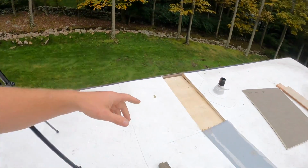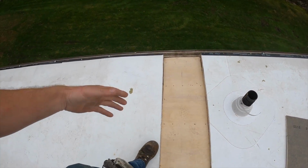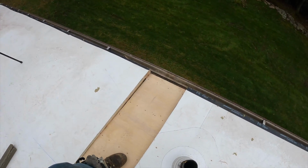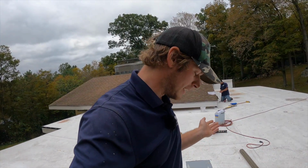Now that we're fully insulated underneath the plywood, we fully insulated with rock wool because the insulation there was kind of nasty. Then we put 2 layers of 1/2-inch plywood, and that's because there's already 2 layers of 1/2-inch down there already. So we're just matching the old with what is now the new.